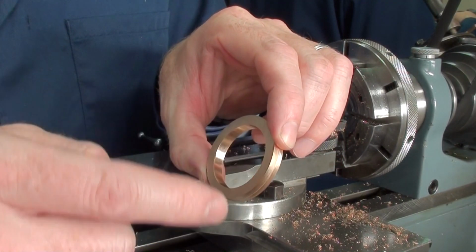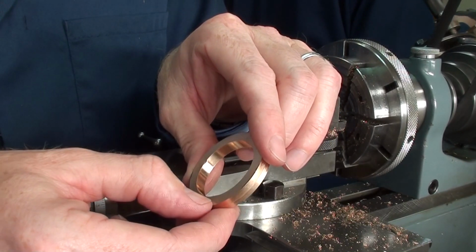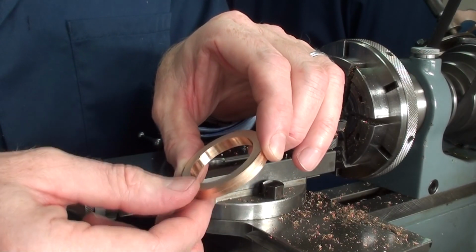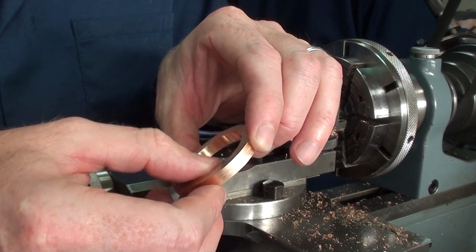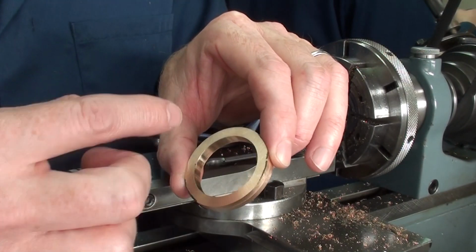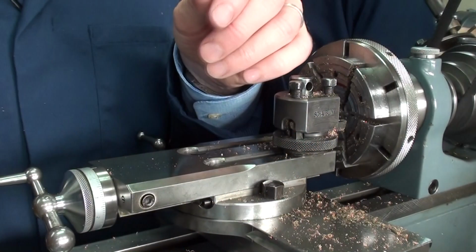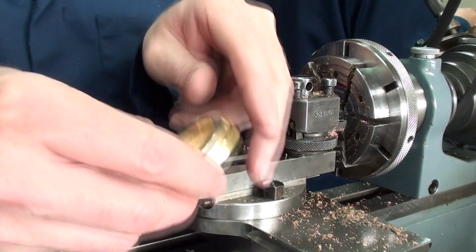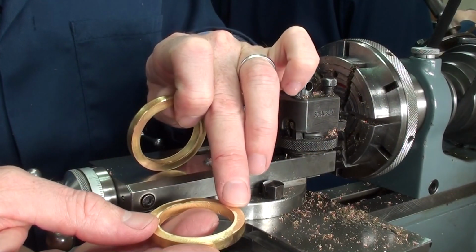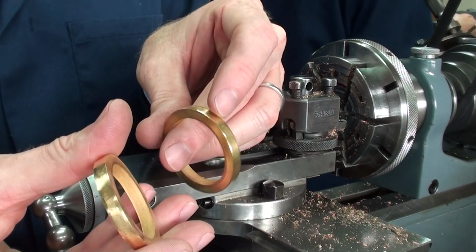And then on the internal diameter, I've left that way undersize actually, and the reason is because eventually we'll cut this for the lugs to be let into, and I just want the extra rigidity for that process, and then this hole will be opened up once the 4 lugs have been soldered into position. So now it's on to turning the case back and the middle, and just doing the same process, cleaning up all the faces and making sure we have nice true rings.